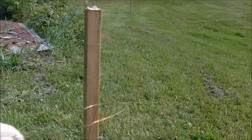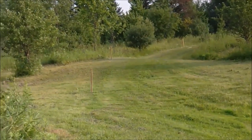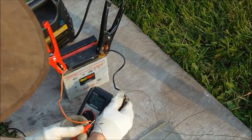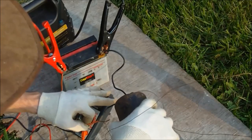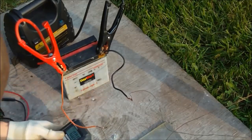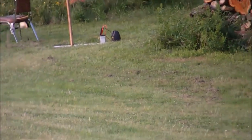I'm going to attach some power sources to this wire here. I'm at the start end and I have a battery hooked up to the little thin wires that go all the way over to our pole. Basically what I'm going to do is show you the voltage now — 12.4 volts. I'll take the motor here; this is a 12 volt motor. This is only low voltage so don't get too concerned. You can see we can easily power up the motor on this end. Now I'm going to go down to the other end and see if we can power up this motor with this very thin wire that runs a couple hundred feet.